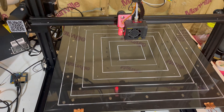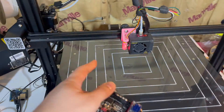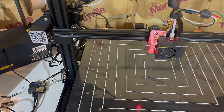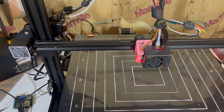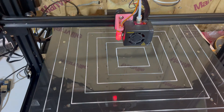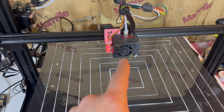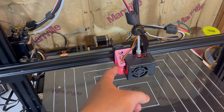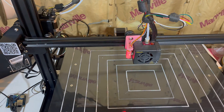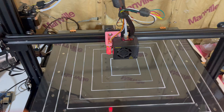And we are done, at least for now. Technically I do have another project for this — I have to install this board. I got this board when I got the BLTouch years ago. The issue was I was just exhausted by the time I got this to work with Marlin with all the custom configuration. So yeah, it works now. This is just a simple 10 by 10 grid, one probe point each point. There are some areas that are a little low, which I can fix by increasing to maybe 15 points and having at least three probes per point, but that would take about 45 minutes. I didn't want to wait that long. But so that's printing great — now I can use the entire bed. I've never been able to use the entire bed.